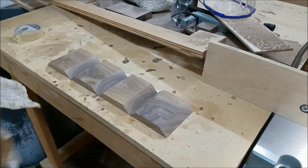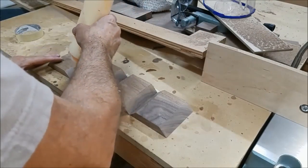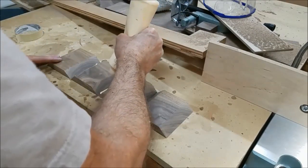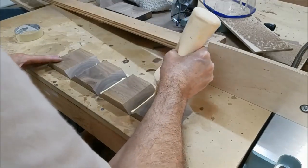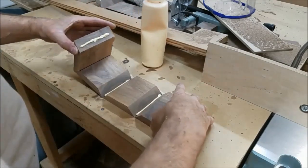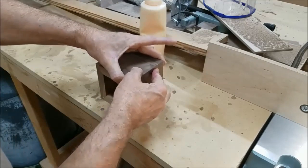I had a Ryobi saw with an 80 tooth Freud blade on it, and it cut as clean as this blade does, and you didn't need any fasteners. You do this, glue it, fold it, tape it tight, it's never coming apart. It's pretty incredible what you can get away with if your cut is clean enough. But it creates such a vacuum that it's like putting water between two pieces of glass and trying to pull them apart. It's really something else.